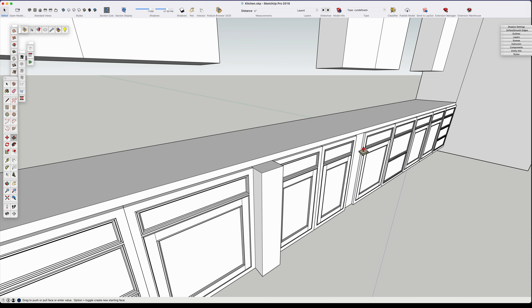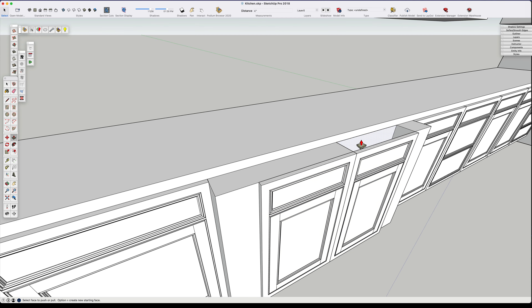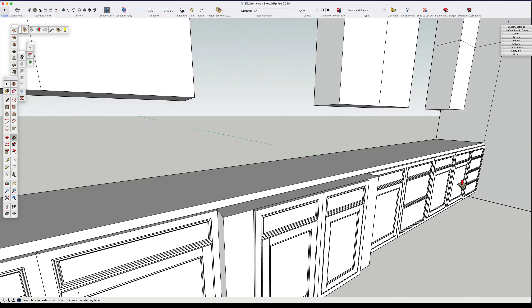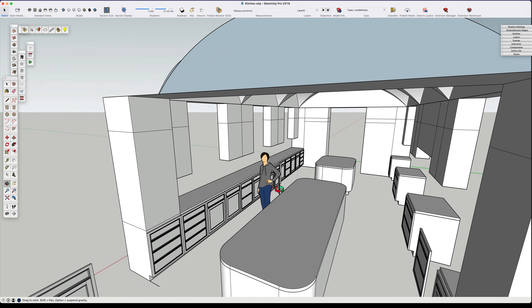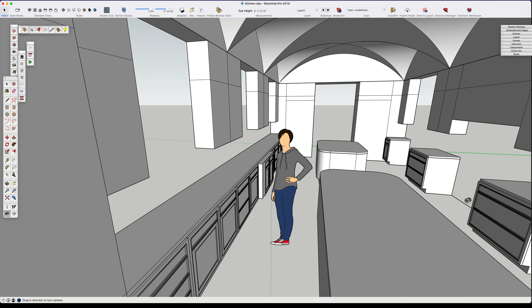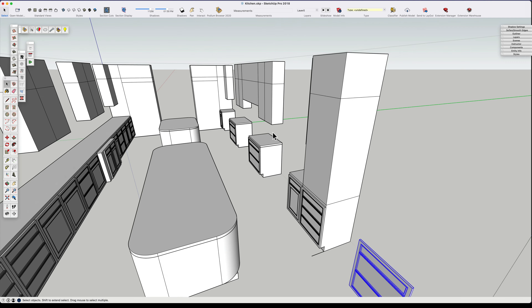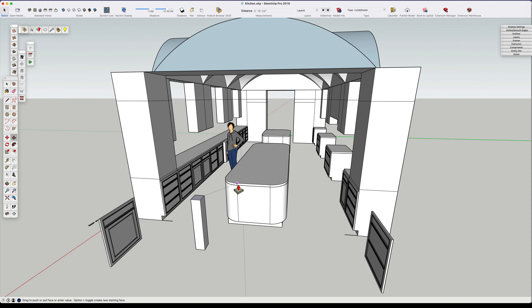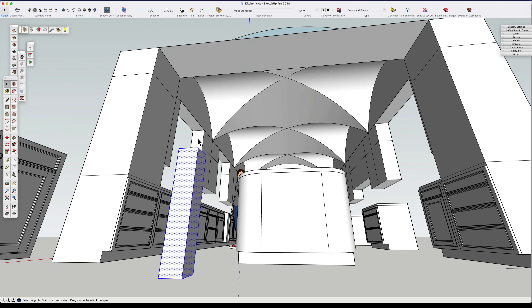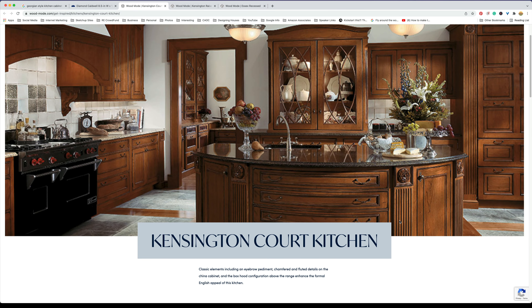On the sink cabinet, I'm going to bring these faces out six inches and on either side of the sink we're going to create some columns. That will make the sink a focal point for the kitchen - the sink is usually the center point of your kitchen design. So we want to give it some emphasis and architectural features. I'm going to move the door frame out of the way, make a six-inch square, and draw it up to three feet tall. It has a baseboard to it.